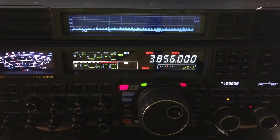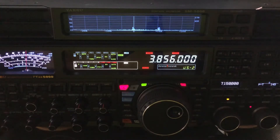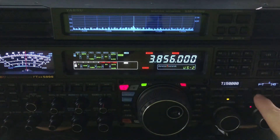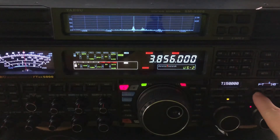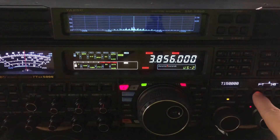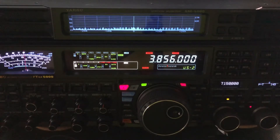I've done a few videos about the mu tuner before, but I want you to see what it'll do to that noise. It doesn't knock it completely out, but with that wideband noise you can see the effectiveness. I'm going to kick it in when the noise starts up again — there we go. The mu tuner is a preselector, and now the noise is going down.